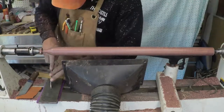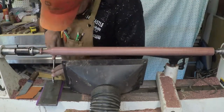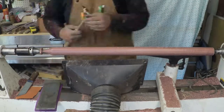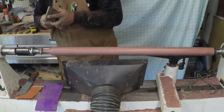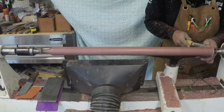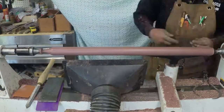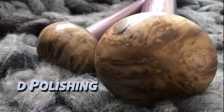This other end is going to be for the button. But I had to sharpen my parting tool. I just used a medium grit diamond plate with a little WD-40 on there to get a nice edge — it's a lot quicker than going to a grinding wheel. And that's about it for there.